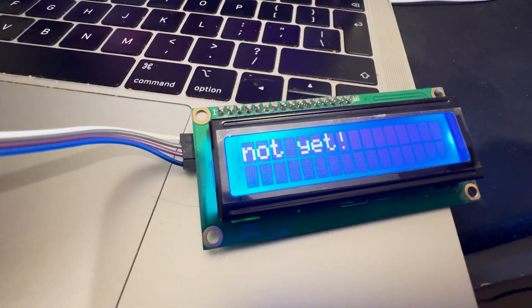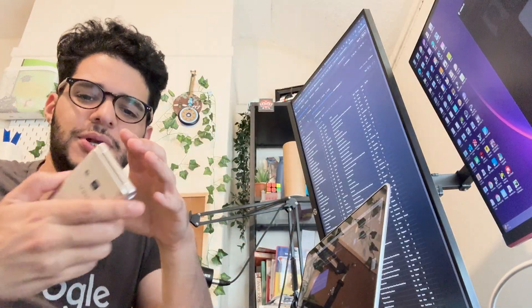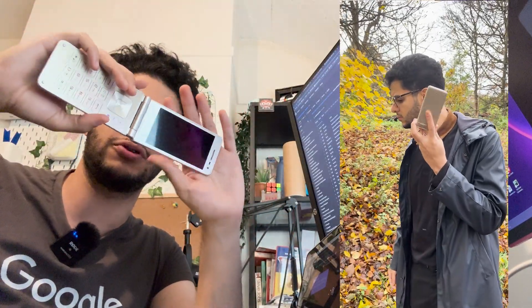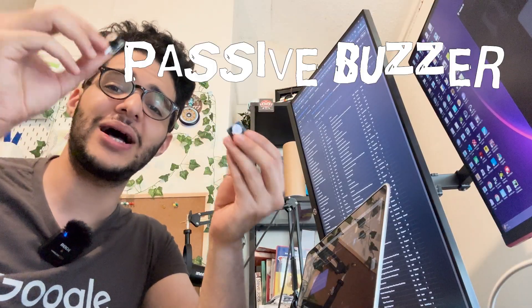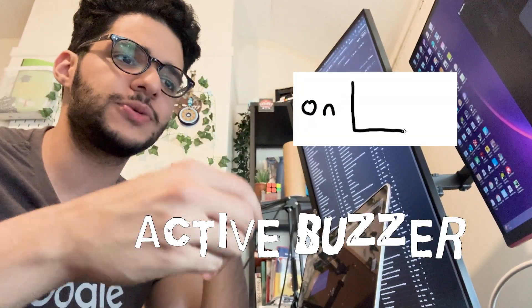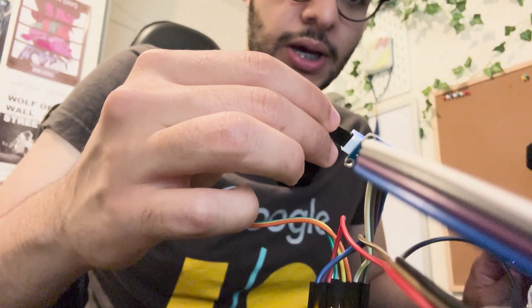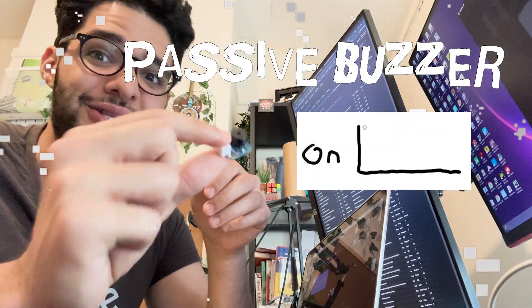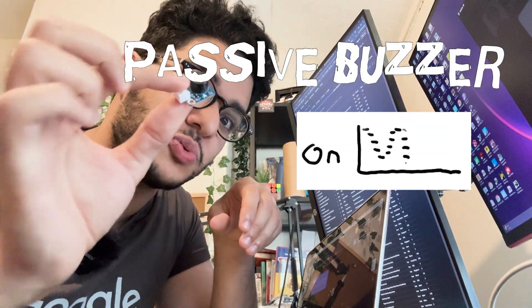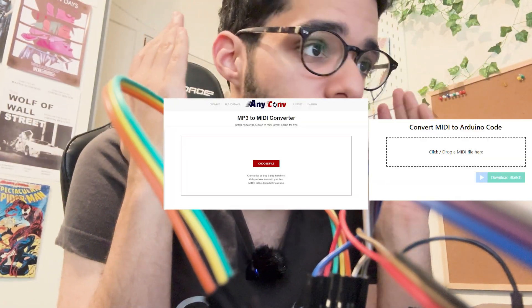It would be nice if the device could notify me when the waffle is ready. I thought about sending a message back to the laptop through an old Samsung folder phone, but then I thought, I've got a bunch of different little sensors. I've got this passive and active buzzer. The active buzzer is more of an on-off switch — think like an old-school Nokia phone. The passive buzzer lets you have different notes, which allows you to play songs. I took a MIDI file of the happy birthday tune, inputted it in, and now we've got this.